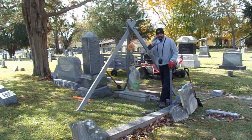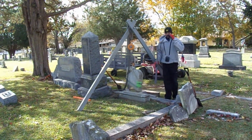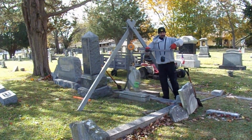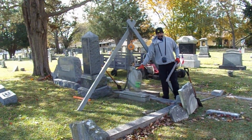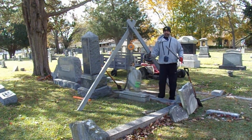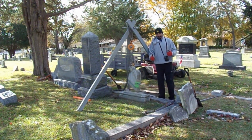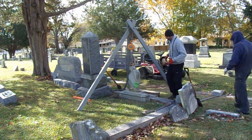It's because in between cuts, Mr. Harmon placed the epoxy on the base. We ran a center bead right through the center, put some epoxy in the holes where the stone would be laid, and then our stone would be pinned to the foundation. This will give it a more secure fit here in the future. And other than that, we're gonna start lowering the stone onto the foundation, and here we go.